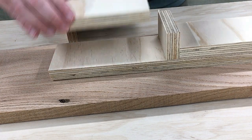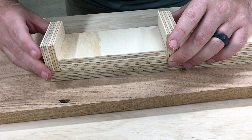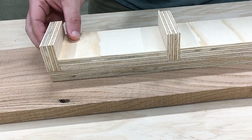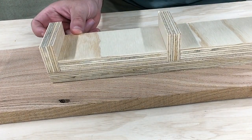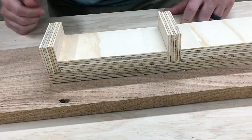I decided to use plywood since it's going to be painted and it's easy to use additive joinery to support the shelves instead of cutting dados, as you can see in the video right here. The laminated plywood gives the table a lot more strength while also allowing the table to be built without screws.